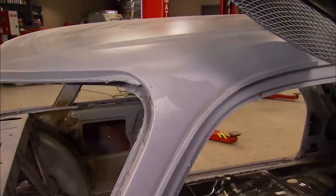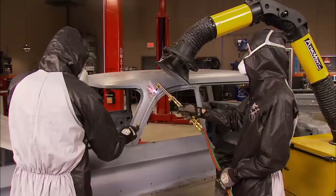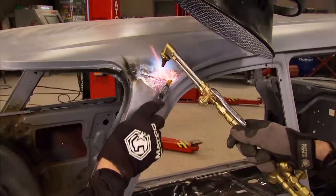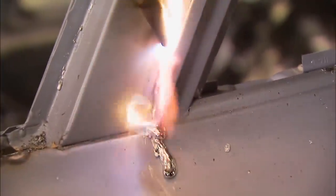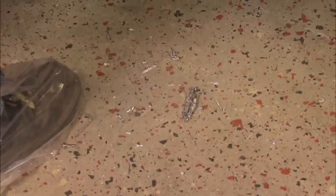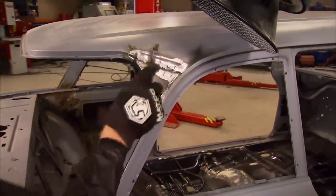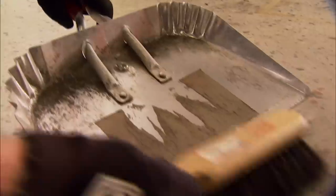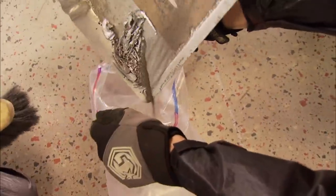Wear a suit and gloves, and don't forget to cover your feet. If a child or susceptible person comes in contact with residue left in your clothing, shoes, or body, they can get lead poisoning, which can cause brain damage. So shower and wash your clothes afterwards. The method is pretty simple: use a torch to heat the lead to its melting point, then scrape it off. The more heat you apply, the more fumes are released, so use as little heat as you can. If you have access to a flameless heat source, use it. Dispose of the lead properly — place it in a six-mil bag and take it to your local hazardous waste disposal site. Don't forget to clean the floor.